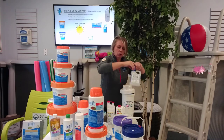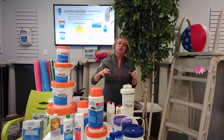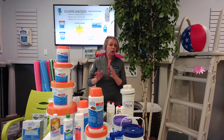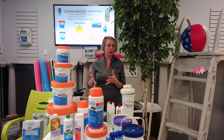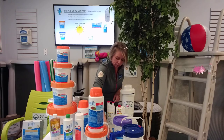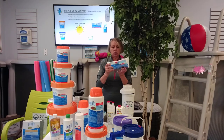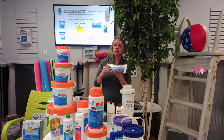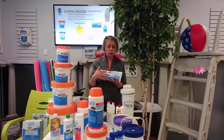You can call and ask us more about those things anytime. Now we have to clean the pool every once in a while too — and that means shocking the pool, not just vacuuming but cleaning the water up. There is turbo shock, which you've probably heard of. It's a strong granular form that's actually going to boost your chlorine levels up a little bit too. Once a week you're going to shock the pool.